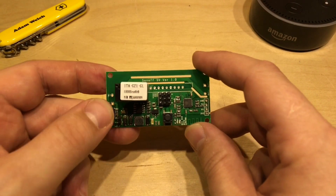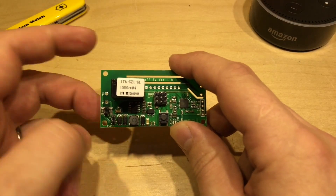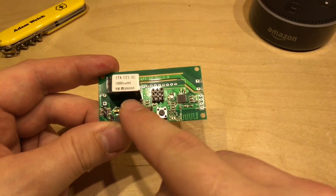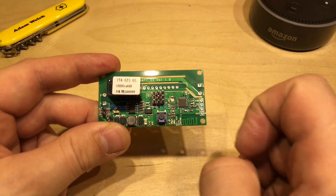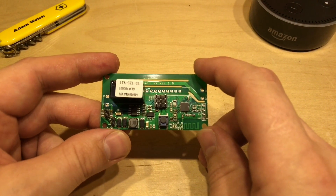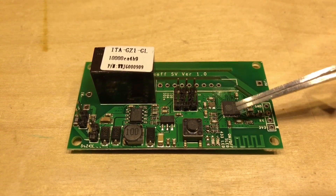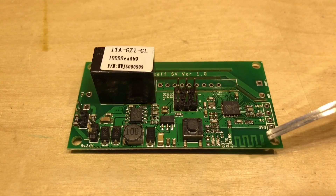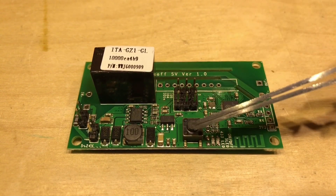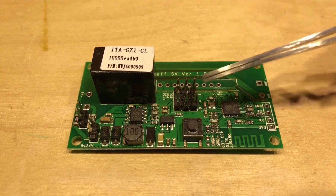This Sonoff SV stands for safe voltage. It's 12 to 24 volts DC on the input on the left-hand side — that powers the Sonoff and is the power for the output on the right-hand side. There's a relay that switches the output on or off, and it's all powered by a microcontroller. If you know anything about Sonoffs, you'll know it's an ESP8266. We can see its track for the antenna on the PCB, there are programming pins, a manual on/off button in the middle, and an AMS1117 3.3V voltage regulator for the ESP.